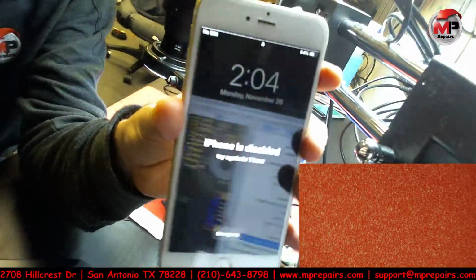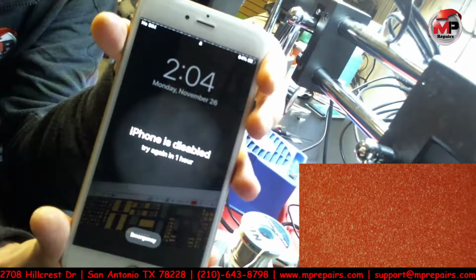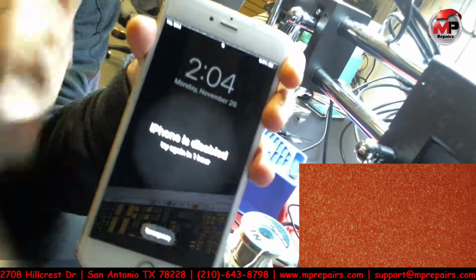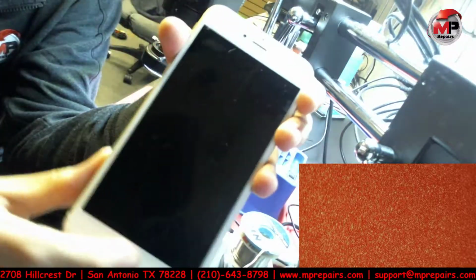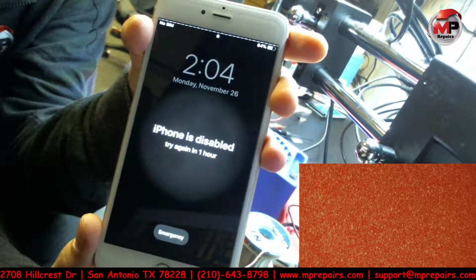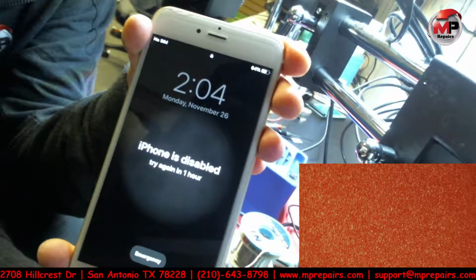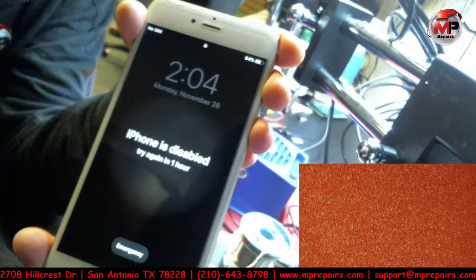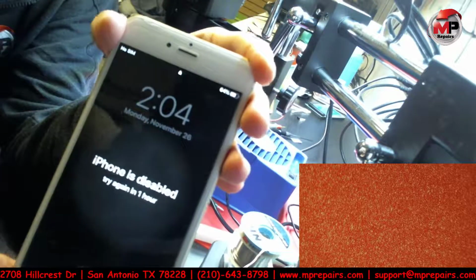All right, guys. So I'm gonna try to go through this pretty quickly. What we have here is an iPhone with the famous touch disease. The best way to usually tell is you can see that line up at the top, going up and down, and then usually as you flex the phone, you'll see that drop. So most people usually end up thinking it's the screen that just needs to be swapped out.